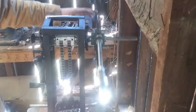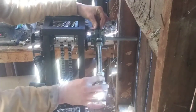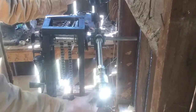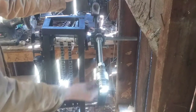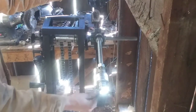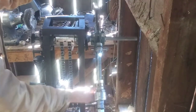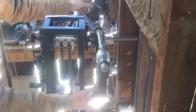So, first of all, you have your main arm. This arm is comprised of a very long stud with some weights. You have a bracket that connects it to the actual main arm shaft here. On the bottom, I have a few points where I can fit a rod through, and if you look, that is where the crucible would go. You have control over where your crucible is on your machine if you slide that rod back and forth. And I even put a little rubber stopper in here in case you drop it. It won't damage the crucible, which of course happened to me already. It's cracked, but that was before I had that stopper in there. So now you can let it go and it won't crack.